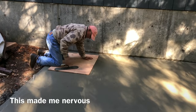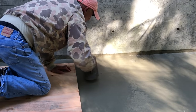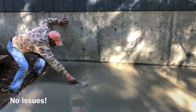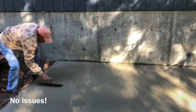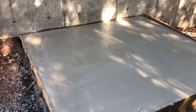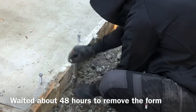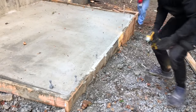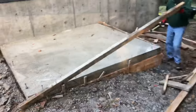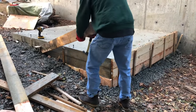Dad wanted to fix a spot in the very middle of the wet slab — only a couple of hours after the pour. I was skeptical but he knew what he was doing and sure enough he did not sink in. Here's what the form looked like, and besides that one little blowout it looks like a proper concrete pad. I waited about 48 hours before removing the form and I think it looks pretty good for a couple of guys who don't really know what they're doing.